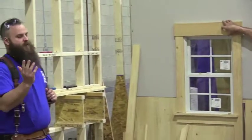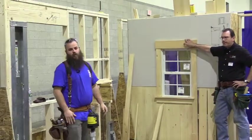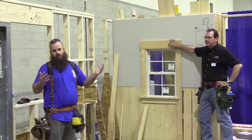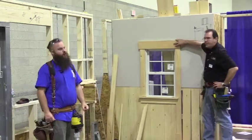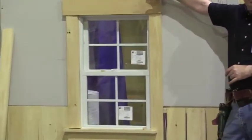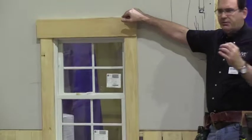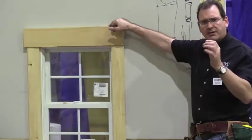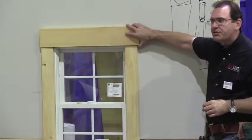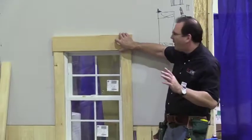This really comes down to the style you're working to. In a New England cottage vernacular it'll be smaller on the end projections. I've seen older homes where it's actually flush — a five-quarter head flush on the ends. But that's difficult, because this joint is going to open up more than likely unless reinforced. Especially if it's painted, because materials expand and contract at slightly different rates and it'll show as a crack through the paint. That's why shadows and projection — character and charm — matter. You charge extra for character and charm.